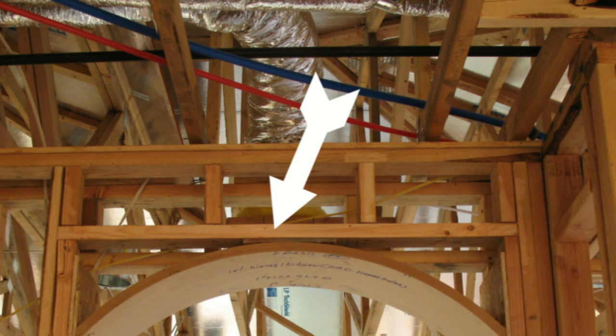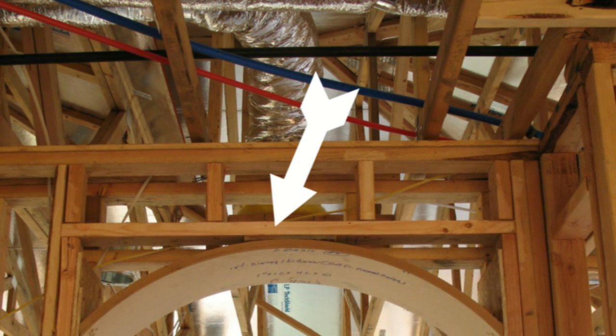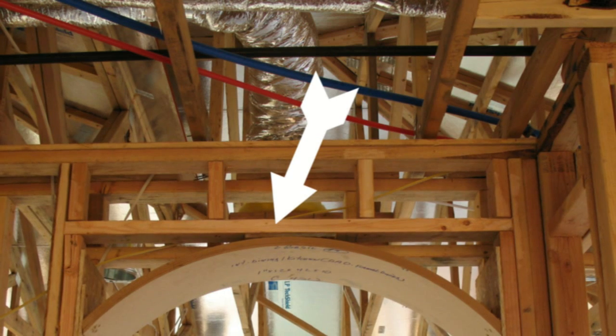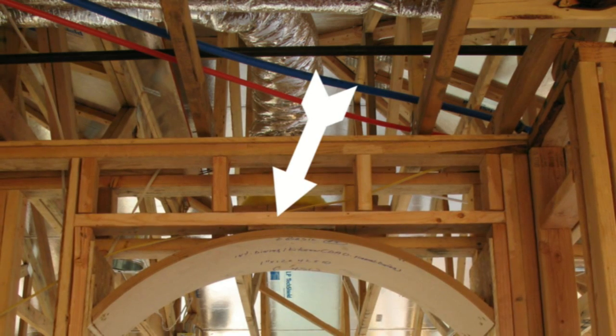Here's a question I get asked every once in a while: how can builders get away using 2x4 for interior door headers? Realistically it is quite simple. If you take a look at the top of the wall, there's a 1x4 plate on top, not a 2x4, and there's a gap between the roof truss and the top of the wall. They get away with it because the roof trusses are designed to carry the weight of the roof all the way to the end of the walls they sit on. So most of the time the interior span of the trusses is going to be non-bearing.